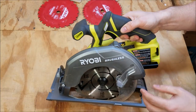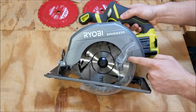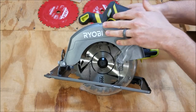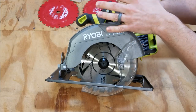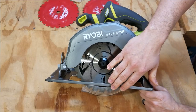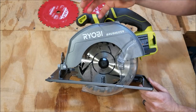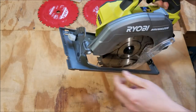The upper blade guard looks a lot like the same material as the shoe, but it's actually plastic — you can push on it and see it deflects, so this is not a metal upper blade guard. They cut some costs here and that could sacrifice a little bit of accuracy. This does fit on the Kreg AccuCut if you want to use it, but Kreg actually recommends not using a saw with a plastic upper blade guard, presumably because of accuracy issues with the way it attaches at the front supporting the shoe.